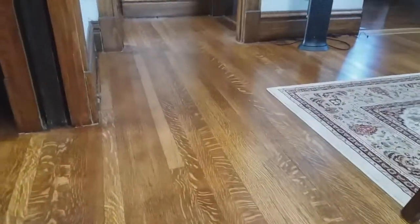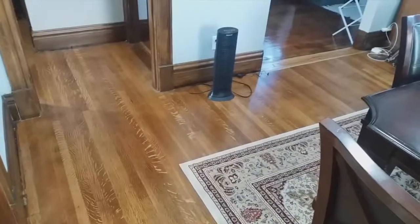100-plus year old floor, redone. The only thing I could say I could have done better was it left some scratch marks — that's from the diamond brush. After sanding it three times at all different grits, it just did not get down there deep enough. I probably should have used a belt sander, but I used an orbital sander so it didn't quite get deep enough. But for me, I'd say it's good enough — so there's the finished product.